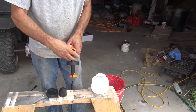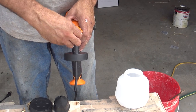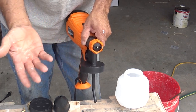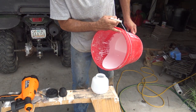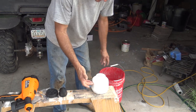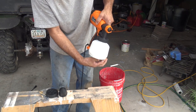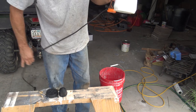Another thing you'll want to do is adjust your spray pattern. Adjusting it this way gives a flat spray pattern; adjusting it the other way gives a different pattern, and that's what I'm going to be using mostly today. Basically it's going to be opposite of what it looks like. We're going to go ahead and load the tank up, and we're not going to exceed the fill line, otherwise we'll get spillage. I'm going to be painting a tall feed bin tank, so I'll put the tube to the back, screw it on snug — you don't want to over-tighten it because you do have to get it back off.